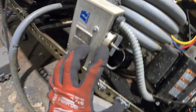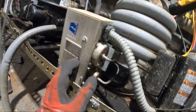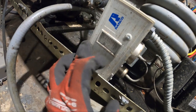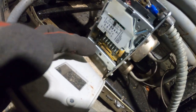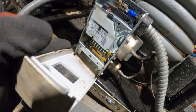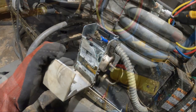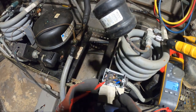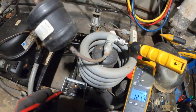If you look closely, we have two rings here. The bigger ring is supposed to be for the low pressure and the higher ring for high pressure. There's only one window on here and it's only showing the low pressure side. This is the low pressure side and this little spring is the high pressure side, but there are no labels — I can't even see what this thing is set to. It's definitely the control holding us out. We've got 120 volts across it, meaning it's still holding us out.